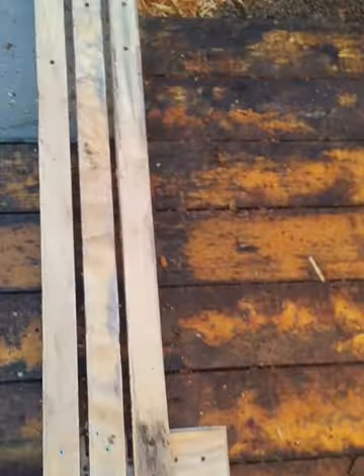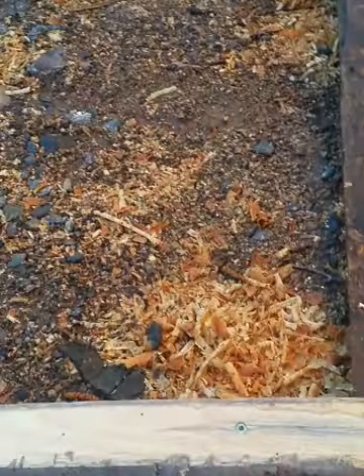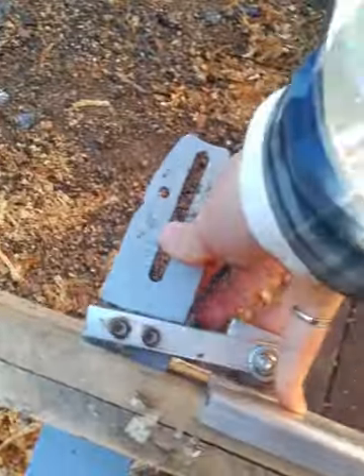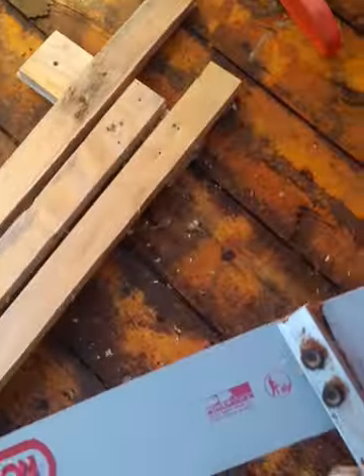As I'm cutting, I use these pieces of flooring — you can see the grooves on the back. I run the chainsaw through the grooves so this piece just slides down the groove, and that's how I maintain my straight edge as I'm cutting. That's it.